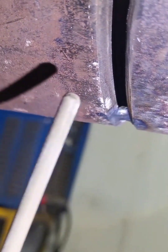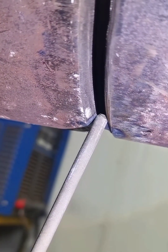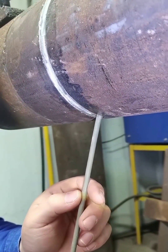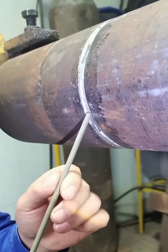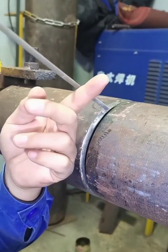Old irons, remember to start the arc every time. Don't be rushed when you put out the arc. Do not break the arc abruptly. The angle of the welding rod during welding: the lower side should pull from 80 degrees, the upper side pulls up from 70 degrees. Gradually change the drag angle from 80 degrees to 70 degrees as you climb upward, always following the changes of position until 12 o'clock directly above.